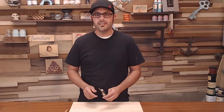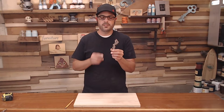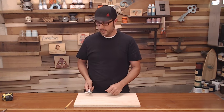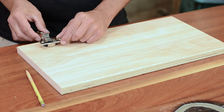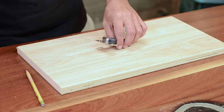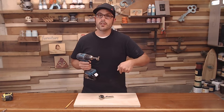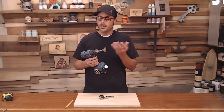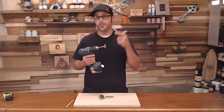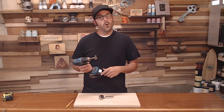These hinges right here are the Blum hinges, made for cabinets. They have a little inset bottom section that's going to have to go inside the wood, so these are going to set in recessed. That is where the forstner bit comes in handy. All the links are down below where you can get this stuff on Amazon — I'm only using the good stuff so feel free to order them down there.